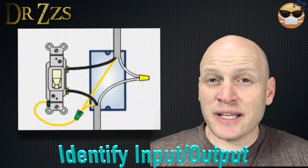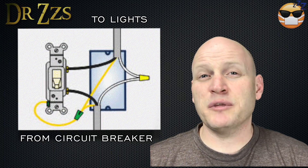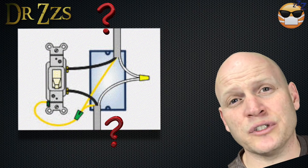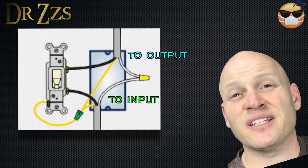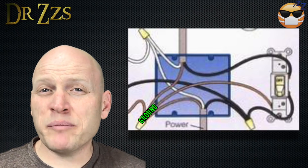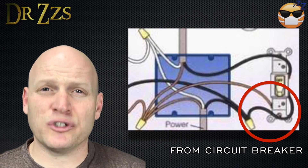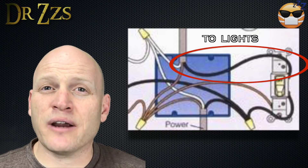Hopefully when you open your switch box, you see something like this. This is the most straightforward connection. Most likely the wires coming into the switch box from the bottom are going to be the wires coming from the circuit breaker, and the wires going out the top are going to go to the light. If you're not sure, or both pairs of wires come from the same direction, just guess and connect two to the input and two to the output — it won't hurt your Sonoff if you've connected them backwards, it just won't work. The third arrangement is pretty similar to the second but can seem more confusing because you'll have a bundle of white wires and a bundle of black wires. One black wire coming from the bundle goes to the switch — that's your hot wire from the circuit. Another black wire that comes into the box alone going to the switch, not from the bundle — that's the wire that goes to the lights.